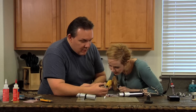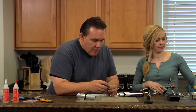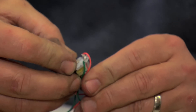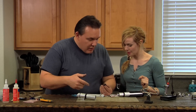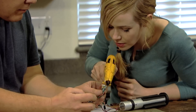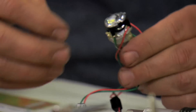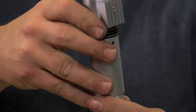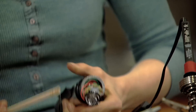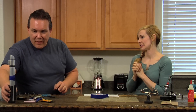I want to put hot glue to help hold it in place — I don't believe the LED will ever warm up enough to melt the hot glue. I can actually stack them both and have them face up towards the blade. We have a lens to put on this to help focus the light because it's not bright enough on its own. This lens is designed to fit one LED but I've got two, so I'm going to cut a couple of the legs off and hot glue it in place — just a little hot glue across the bottom and top. I want to make sure the focal point of the lens is over the blue LED because that's what actually makes the blade glow. Then we'll epoxy it — just put it all on the top up here. Five-minute epoxy, let that set up.